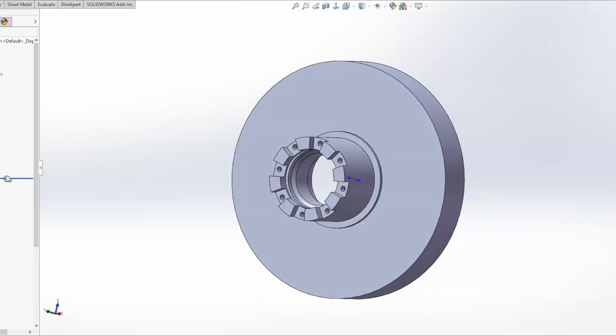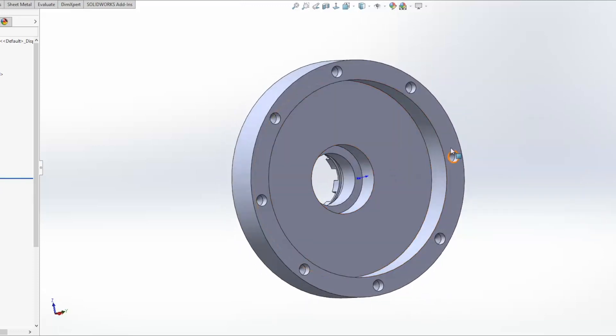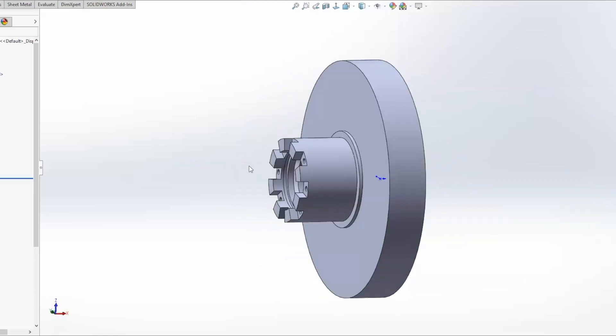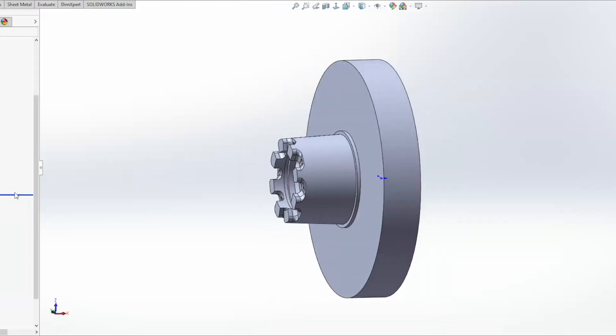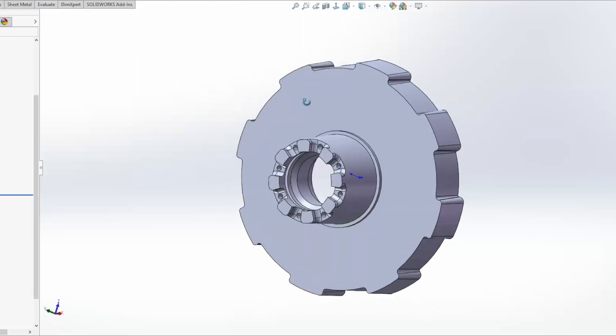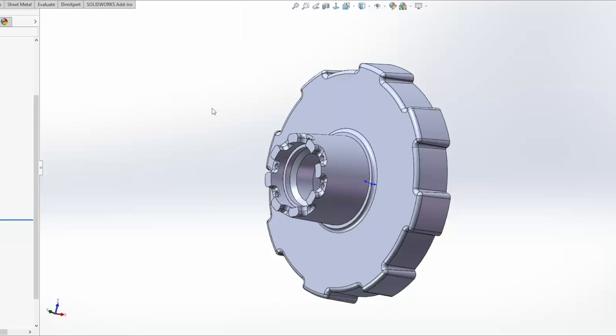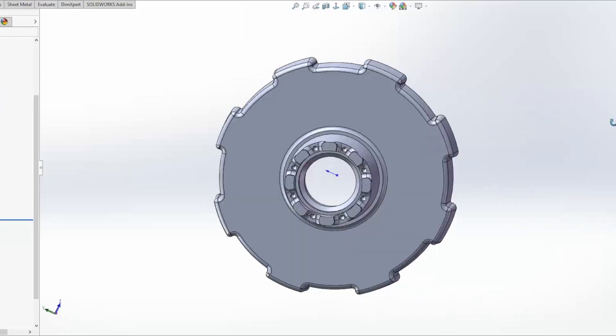For a mold to work, you have to have draft angles on all the faces that are going to be pulled apart. There's also generally a need for a lot of fillets. We're also going to try and minimize the material, at least relative to a machined part where you minimize maybe the number of operations. So adding some draft and fillets, minimizing some of that wall thickness out here on the edge, removing an undercut there, adding some fillets on the outside, adding some fillets on the inside.